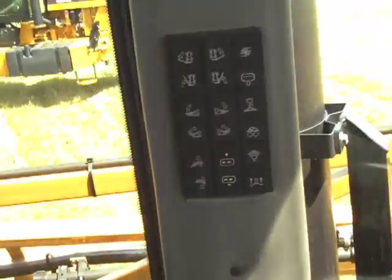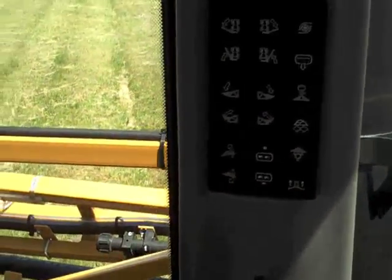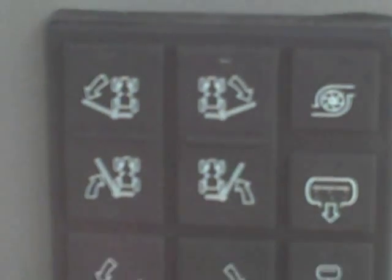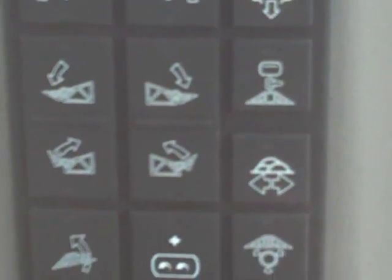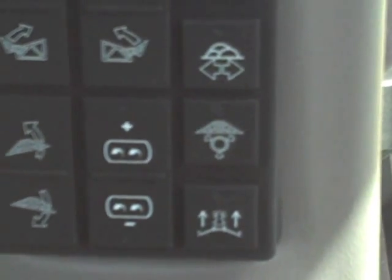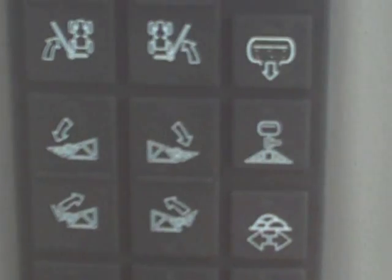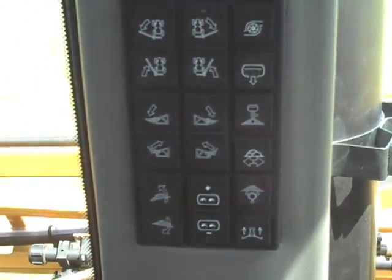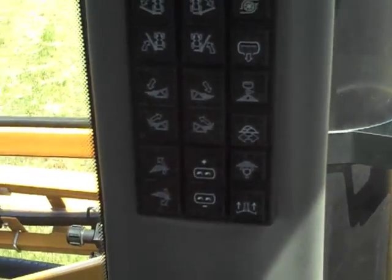On the side panel, we have our side post buttons. Those are the buttons the operator will use whenever he's starting or stopping a field — boom swings, tip bolts, turning the pump on and off, adjusting the agitation, things like that. It's not a regular-use button, so that's what he'll find on the side.